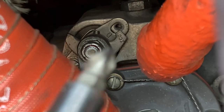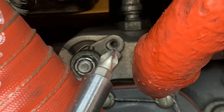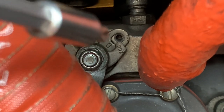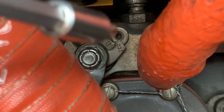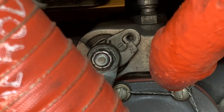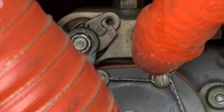We just finished engine runs and this is something I noticed when we started. That area should have a screw in it with a stop — that is the stop for full lean — so we should be hitting the stop and that should kill the fuel. What's happening is that because the throw in the cable is longer, it keeps going past that stop counterclockwise when you pull it out to lean. That opens the valve inside the unit enough that fuel flow goes back up, because it's just a butterfly valve.